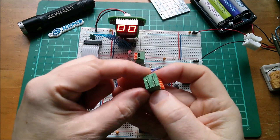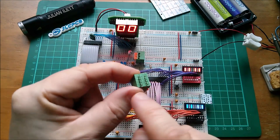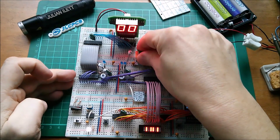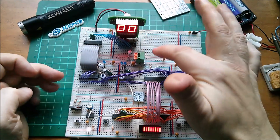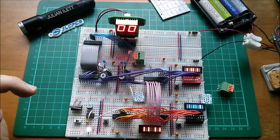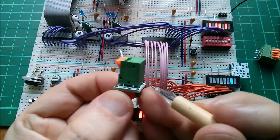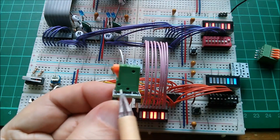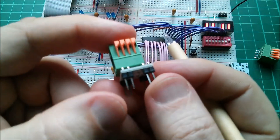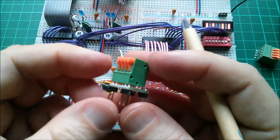Now there was one other function of this board — I can put a connector on here and actually bridge across there for even more power distribution. These were the connectors I bought; they're on a 0.1 inch pitch matrix, 0.1 between pins. I've put some pads on here to take this. I've just discovered that it won't quite sit flat on the board — it slightly fouls these pins on this side and these pins on this side; they're splayed out a little bit.